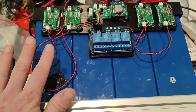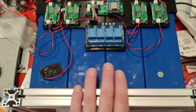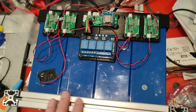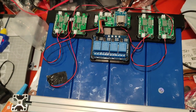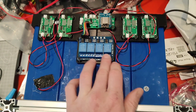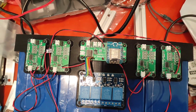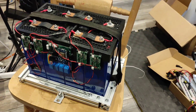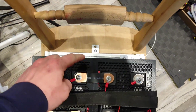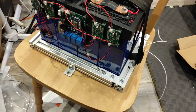One further step I'm going to do, although not quite yet, is to add some PIR insulation — I've got leftover 25mm insulation which I'm going to put around these battery cells to help keep them insulated so that temperature is better maintained, obviously leaving enough space to easily access the ports on the relays. Before we get that far though, I'm going to get on with wiring up the top of this battery pack.